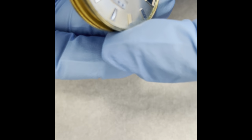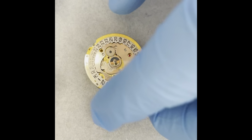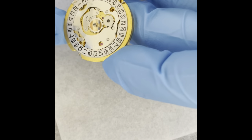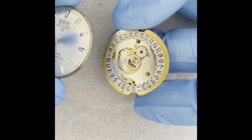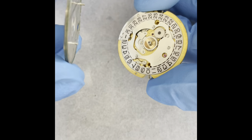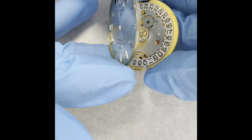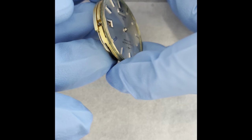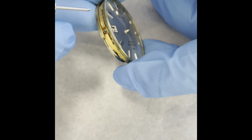I don't know what the key factors for that is, but I do believe it comes down to what kind of gasket lubrication they used when the watch was new, or perhaps when it was serviced at some point. I doubt the factory used something that would have had acid in it, because good condition ones don't have it, so I doubt the factory would have done that. So it must have been something some of the watchmakers used back in the day that could have had that effect.